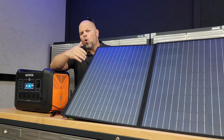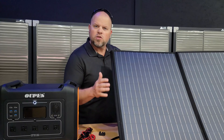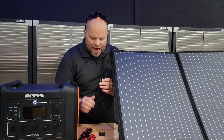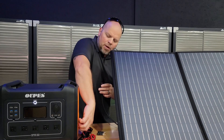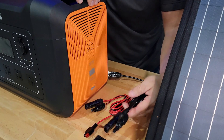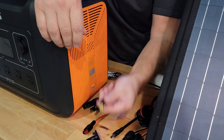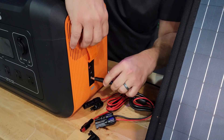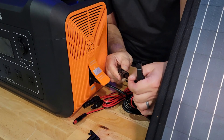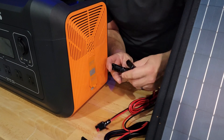You could buy solar panels directly from Opus or use third-party panels. A couple of things to keep in mind: the voltage must be between 12 and 30 volts, and you want to make sure your MC4 connectors have the right adapters to plug into the side of the unit. For example, we have the two MC4 adapters here — this is the Anderson plug, which plugs into this connector, and then the MC4 plugs into the solar panel. You can do the same with the Anderson plug.